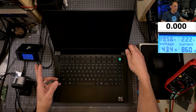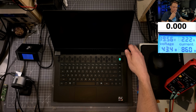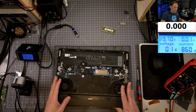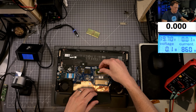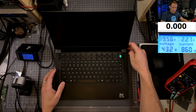Okay, now we're back at sitting at that 2.2. So I'm wondering if we had triggered it into BIOS recovery mode, and so it kept trying to look for those BIOS files every single time until we did the CMOS reset again. I bet that's what we did. But I'm going to move the other memory stick into the other slot real quick, just for kicks, and that way we at least did all that. So now we take this stick out, and we're going to put this one in this slot, and that way we had every combination. Turn it back on. Back to that 2.2. All right.